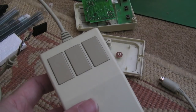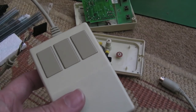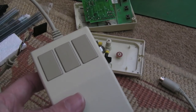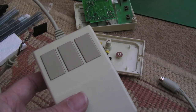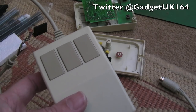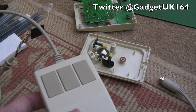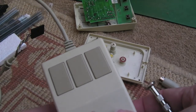We did the same mod to put some heat shrink onto the rollers. This one here was the first one I did, and I didn't cut this piece very well - I might just snip that off and put a new piece on. But it is working, it rotates properly in both axes with the metal ball. So all of the things we did mechanically there - fine. Anyway, special thanks to Zarkos - he's also just sent me another parcel with two more Archimedes. If you're watching this, Xavier, please do not send any more - I have no space. But yeah, there will be a follow-up video when we revisit and do the other three or four mice. Hopefully you found that interesting. Thanks for watching, catch you in the next video.